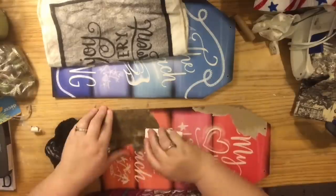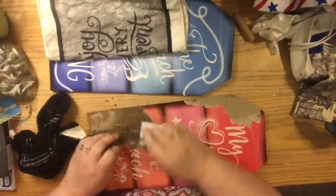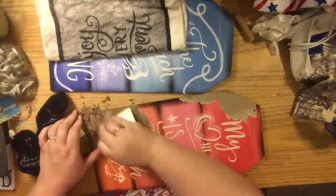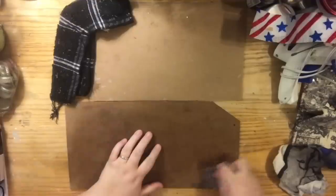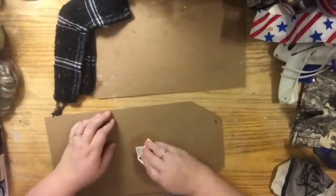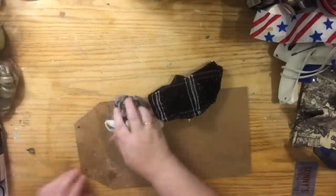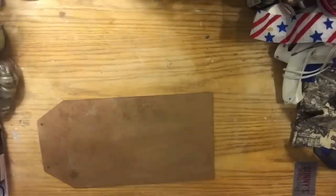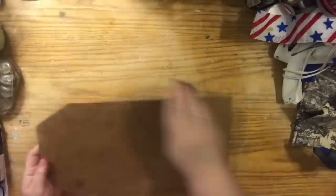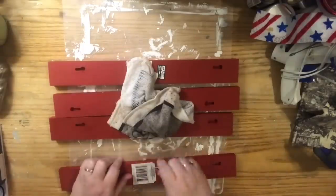When you get down to the cardboard section, rest a wet dishcloth on it — it becomes super saturated and soft, the glue softens instantly, and you just scrape it off with a gift card or an old credit card. Just don't use a razor blade because you might gouge the particle board. We're also going to remove the stickers the same way, though you could use heat as well. Just try not to use Goo Gone because it can leave an oily film that affects the paint.